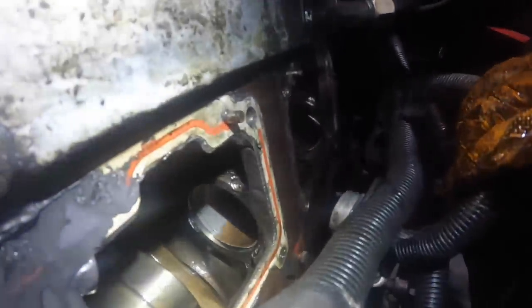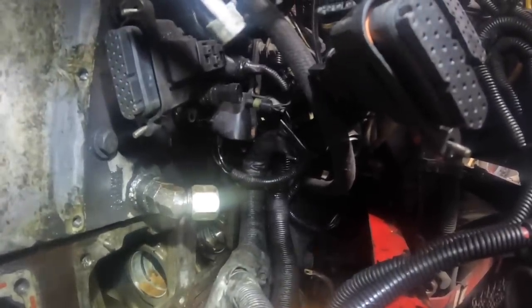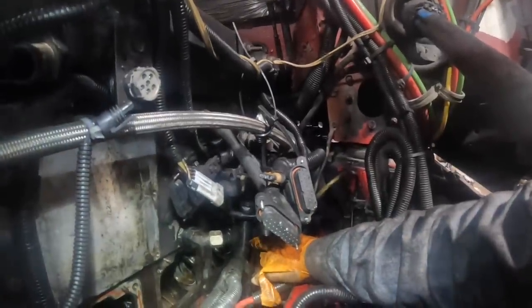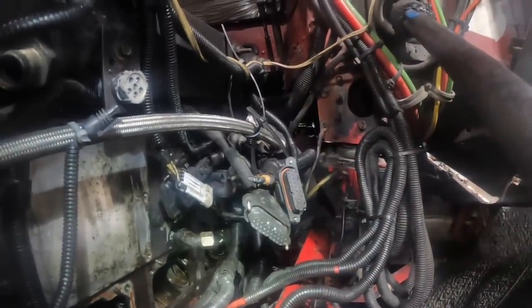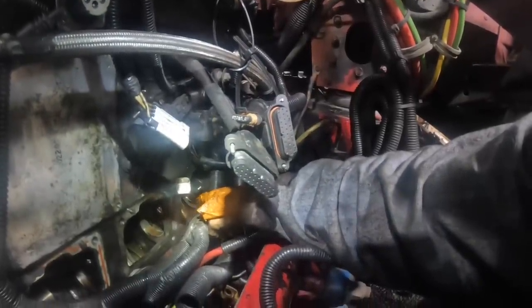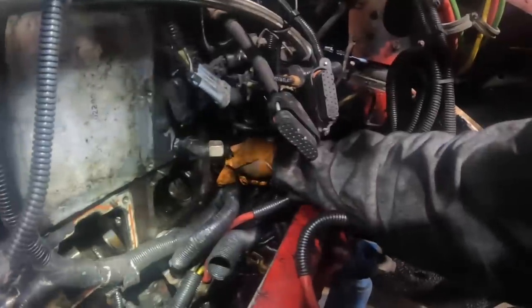You can see how they're down into the bronze on the cam bearings — it needs cam bearings really, really bad. Why not put cam bearings in while you're here? That last cam bearing — I'd have to pull the rear structure off to knock it out, but the back one is right up against the bell housing with no way to drive it through. Maybe someone could get in there at an angle with a die grinder and cut the bearing out, though you'd get metal down in the engine. I've got to give this guy a call and see what he wants to do.